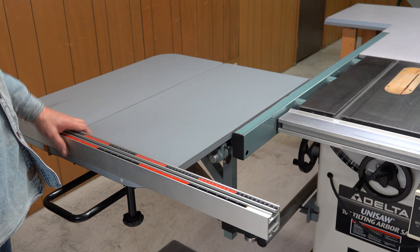And for this fence, you snug these big bolts down and it forces nylon tighter up against the fence and gets nice and snug. So the next one from there that's a good idea is having your fence perfectly 90 degrees to this surface. And once you have that, then having this track properly with the slot. And then your fence is all ready to go.